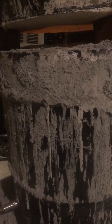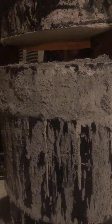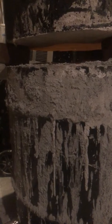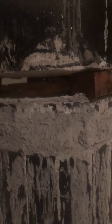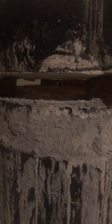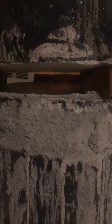I made this refractory cement out of a high-temp clay, which was cone 9 I believe, and I used sand. On a couple of the pours I even used graphite — the last pour, the second to last, maybe even the third to last — I used a good amount of graphite, it might have even been graphene dust. I impregnated that in there just to help withstand the heat. The top doesn't have any graphite in it, but I think it's going to be all right.